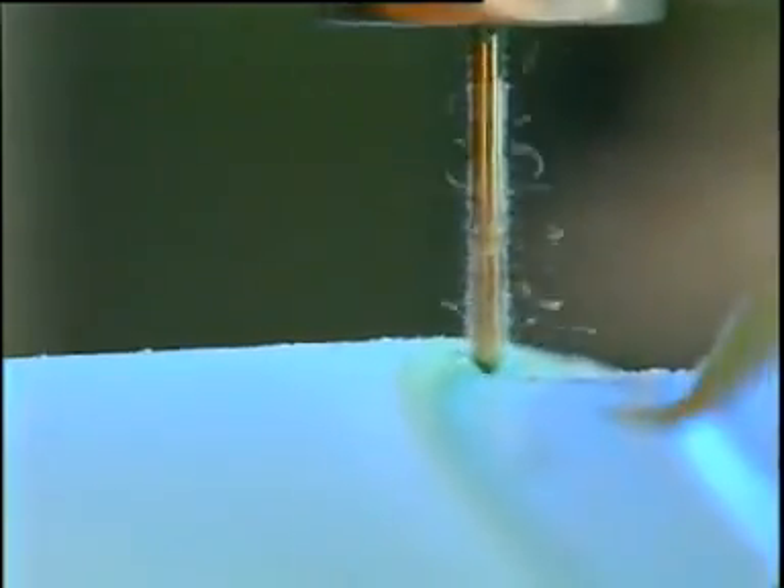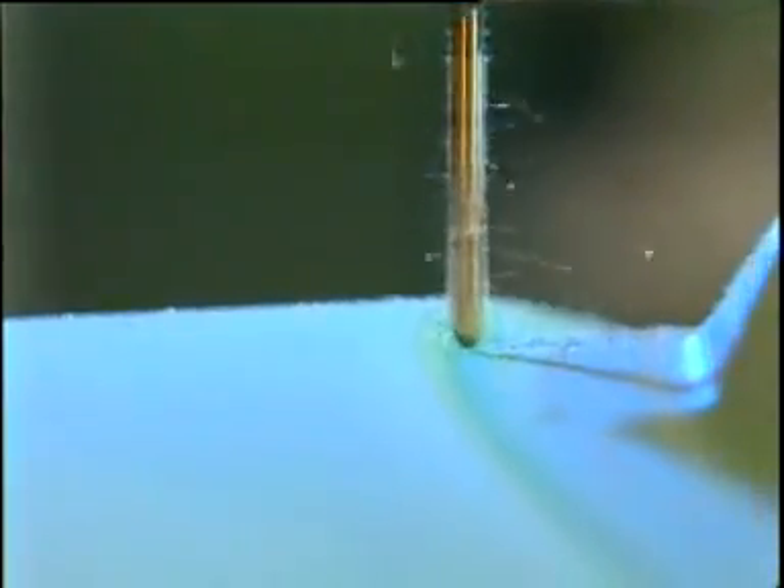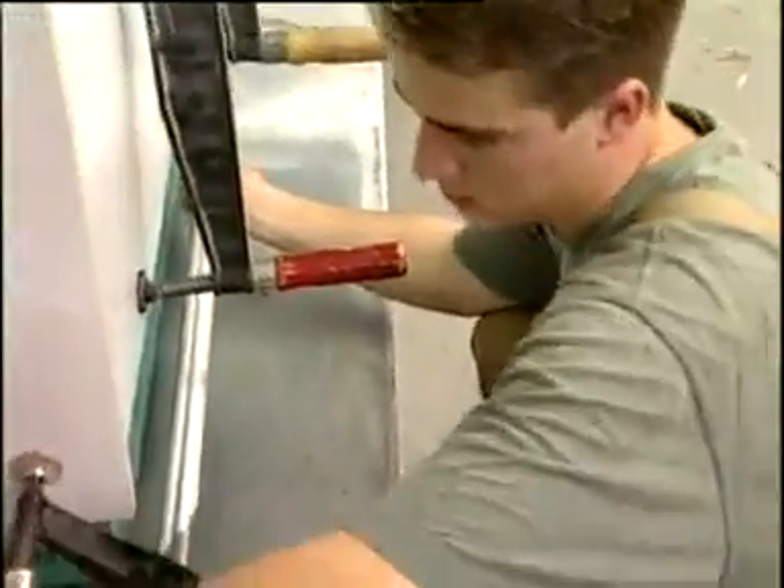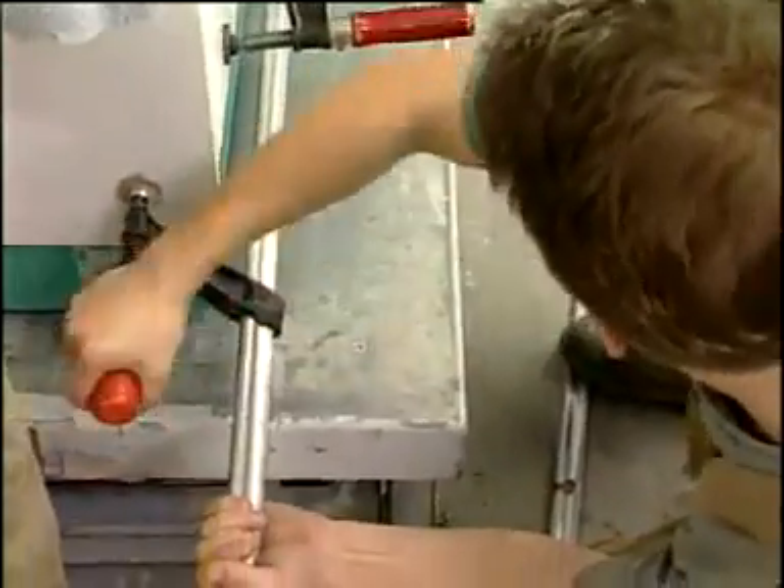After the coarse milling, contour smoothing, and tightening of the radii, the punch is carefully waxed. A mold is prepared, and the core of the die is then cast.